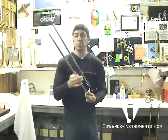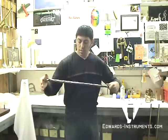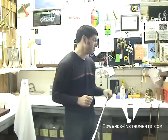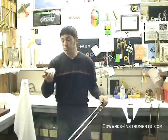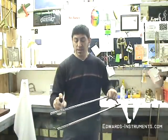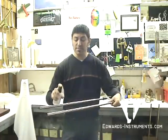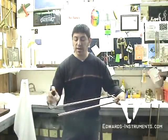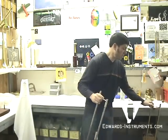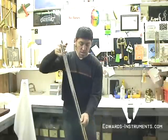You want to do your visual inspection. Make sure you can't see it. Again, if you see that white haziness, too much, remove some. Now, we use just distilled water. We don't use tap water. The reason being, tap water has fluoride, calcium, iron, all sorts of stuff that can end up leaving deposits long term on your slide. Once you've watered it, then you just carefully put the slide back together, and your job is done.